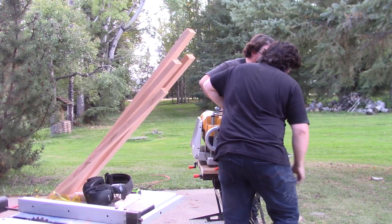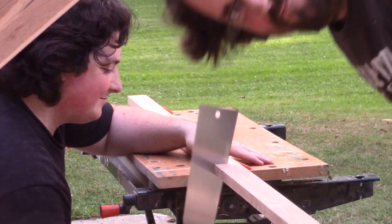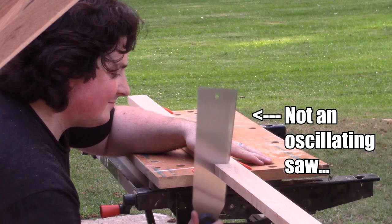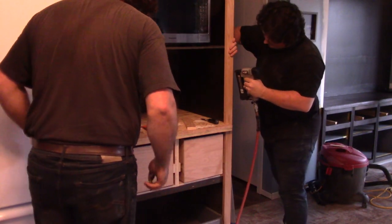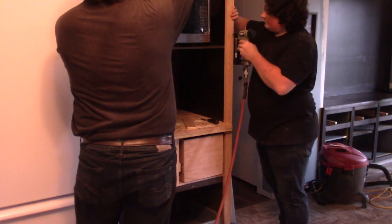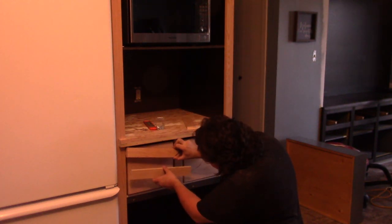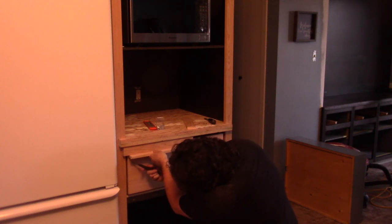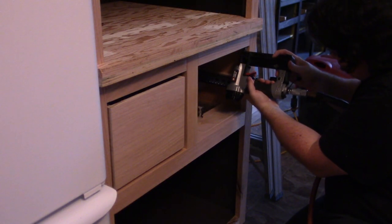To take care of the burning on the edges and mill the boards to final dimensions, I ran them through vertically as well. With the milling done, the planer packed away, and the workbench usable again, I clamped down one of the boards and cut a notch out of it to fit around the countertop with my oscillating saw. Cleaned up the cut with a chisel and attached the board to the cabinet with some pin nails. I realized that I built the drawers a little bit too tall, so I marked out the face frame with a half inch extra and cut off the extra at the table saw. Then they were good to go, and the rest of the face frame went up without a hitch.